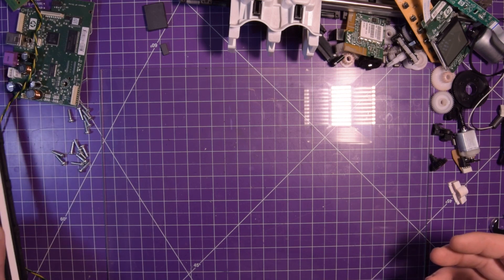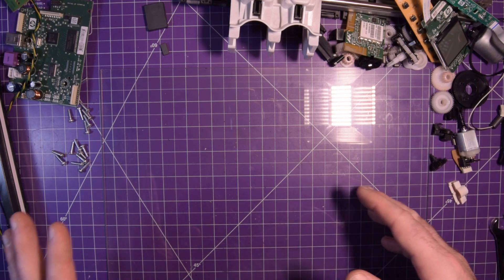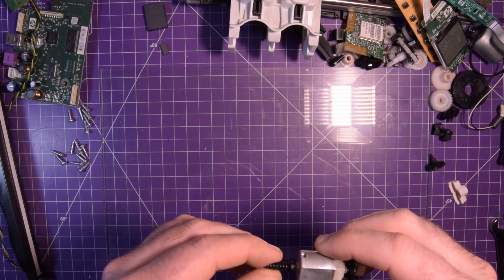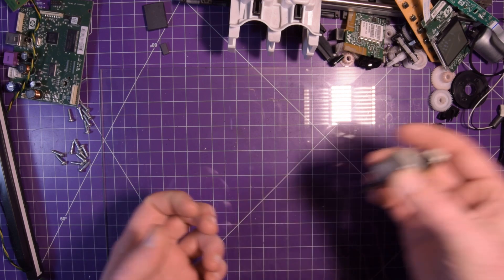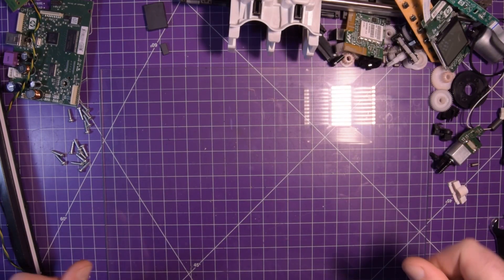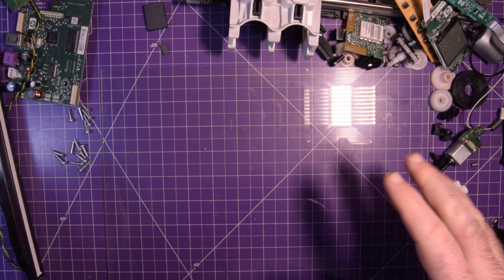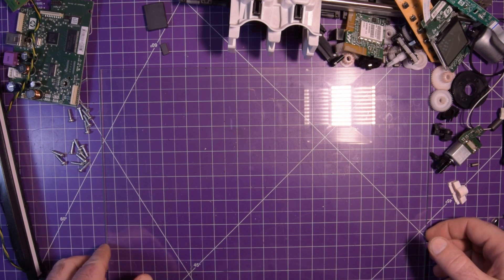I just wanted to show you that free printers might be a good source of components for you. Back in the day, the older printers, you can actually find stepper motors in them. Today's throwaway printers, a lot less so. But if you have these DC motors equipped with an encoder, it's kind of the same thing — it takes a little bit more programming, but you can achieve similar results. If you have any idea what kind of projects you'd like to see with some of these pieces, let me know in the comments below. I just wanted to make sure that you guys didn't pass up on free printers in the trash or on your used sites because you didn't know that it had cool components inside. Thanks for watching.